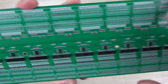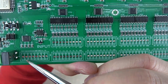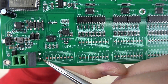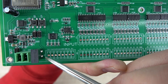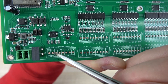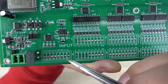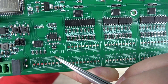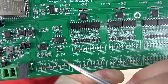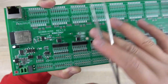Let's look at the pin definition details. There are four channels of analog input: two channels for DC 0 to 5 volt, and two channels for 4 to 20 milliampere, so it can support different sensors. The A and B terminals are for RS485 for long distance Modbus communication. You can write your Arduino code for Modbus communication with this board.